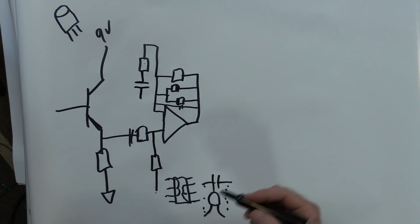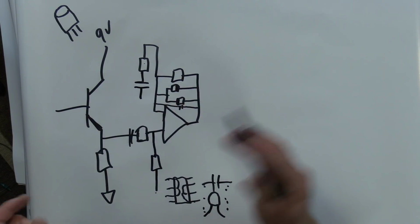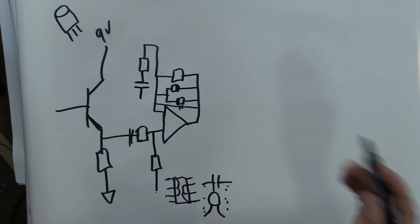And so if you want it a little fuzzier, you're gonna make the values in such a way that it's gonna boost more bass. Tubescreamer's boost starts around 720 hertz or so. So it's fairly mid-rangey, of course. So that's also why it's a little crunchier and not very flubby.